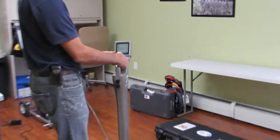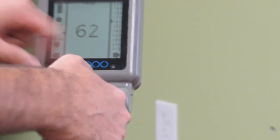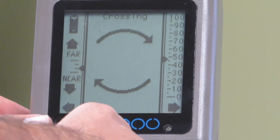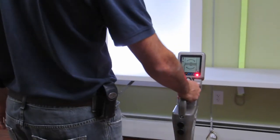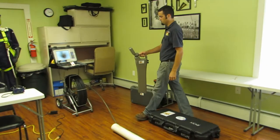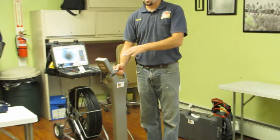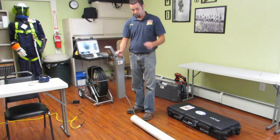The next step is to go to the right to Step 2. It's going to ask me to walk in a circle around the area I've just located. When I get directly in line with the camera, it lights up solid on the pipe, vibrates the handle, and the little red light comes on. I mark that spot on the ground and continue walking around. When I get directly on the other side of the camera, it gives me the solid pipe indication again and I mark that spot.